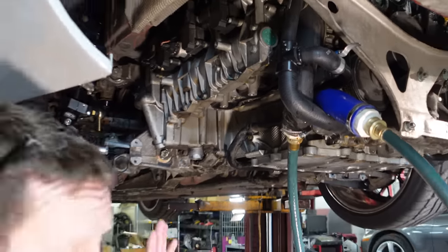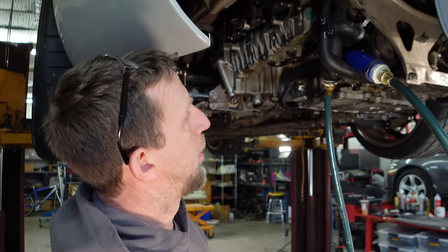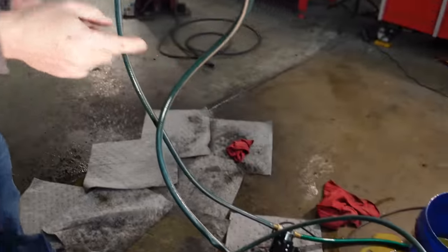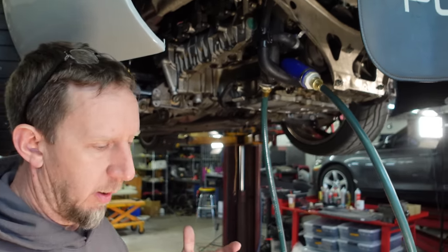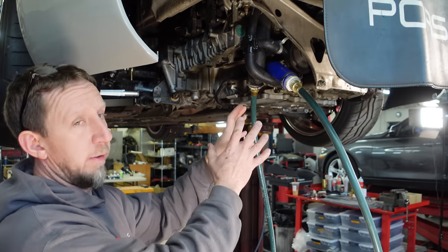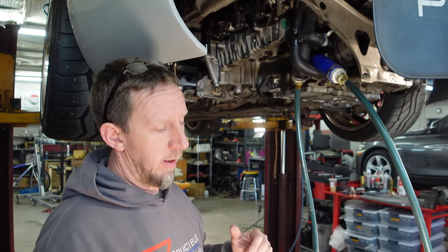What we're doing with this whole setup: we're drawing clean water — well, water with bilge cleaner solution in it — with a pump, pumping it into the engine, and it runs through the whole coolant system and comes back out into the bucket. We were originally running it into its own bucket until we got the worst of the mess out, then cycling it and letting the residual oil float to the surface, pulling from the bottom. Now we're ready to drain again, run more solution through it until we get it all out, and then put coolant back in.